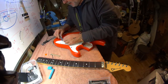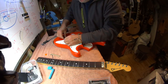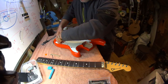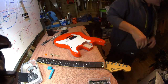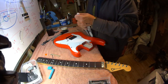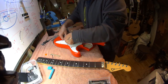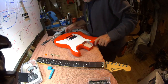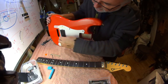Up you go. It's quite difficult anyway to get knobs off without damaging the underlying pots, because they are always pulling upwards, and I don't think the pots really like that kind of pressure. Some people like to use two spoons together. Sometimes I used to use a bit of cloth to get me an upward pull. It's not working today. We do need to get this out, otherwise we're not going to be able to do any buffing. It really is reluctant.